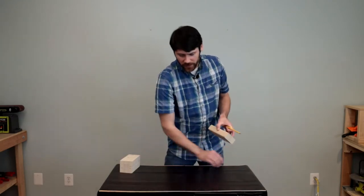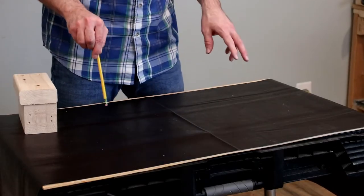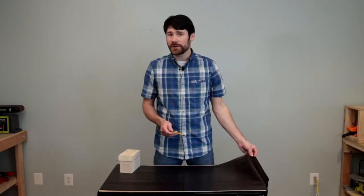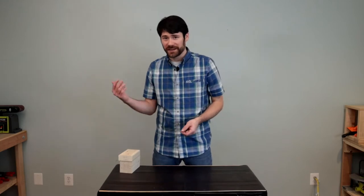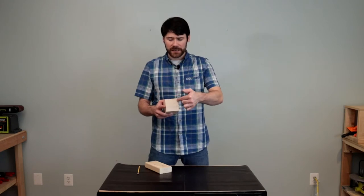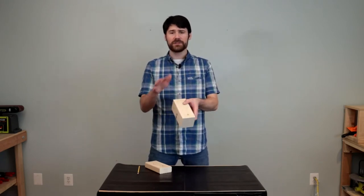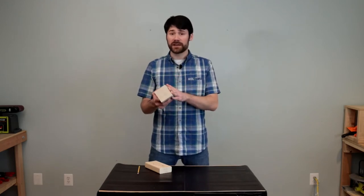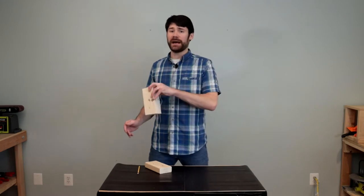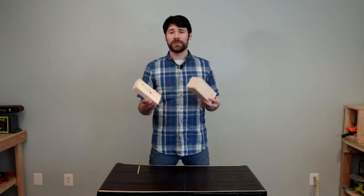The material on our table is a leather-like material picked up from a big box store — half a yard for under three dollars. It's going to be nice, soft, and somewhat grippy. We're just going to use an old shirt as padding under the material. I want to maintain the neck radius on the block for the neck support so it keeps the guitar neck steady. I'm going to use the bandsaw and then come back with the belt sander to clean up inside, and we'll do that for both blocks.